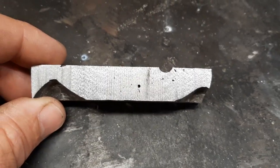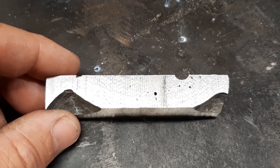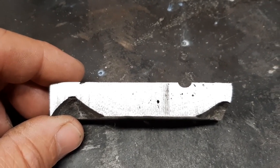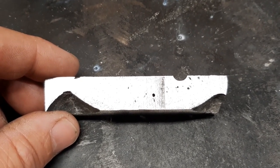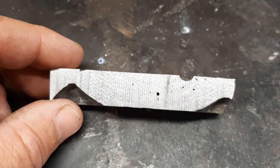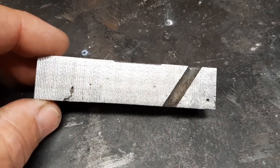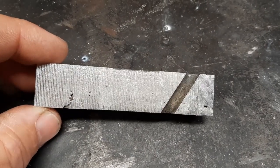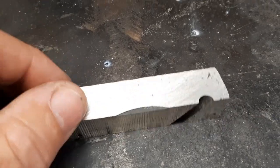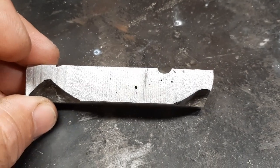One last thing I wanted to mention before I started welding on this is, I saw in the other videos I had some pitting, some little impurities where I was welding onto the casting. Well, here is a chunk of the casting just as is. You can see it's got the same little pits, contamination, whatever, in the base metal, just from the casting process. Not horrible, but it is all through it. So I'm certainly not worried about a few little pits where I welded it, since it's not a structural piece anyway.